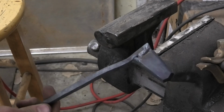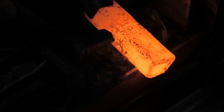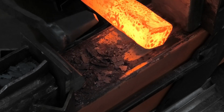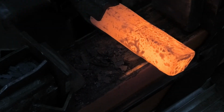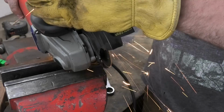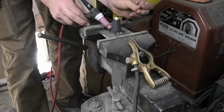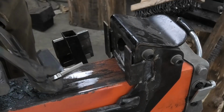and then I started doing some math. So I need one hand to hold onto the hammerhead, I need one hand to hold onto that punch that I just made, and I need another hand to use the press. Something's not adding up. So after I stared at it for a few seconds trying to figure out what's happening, I figured out that I just need to cut it off and weld it onto a piece of steel that I can slot into my press so that I can use it without any hands. And now you can watch me punch the hole. And spoiler, it went okay.